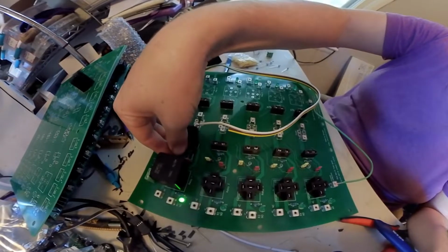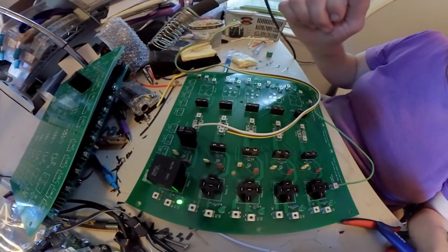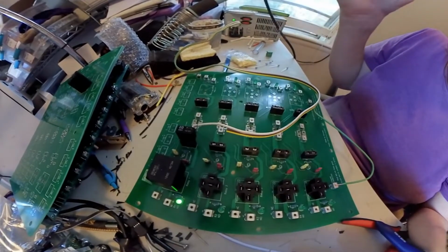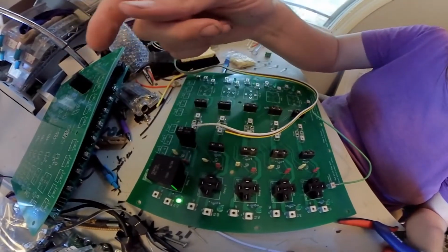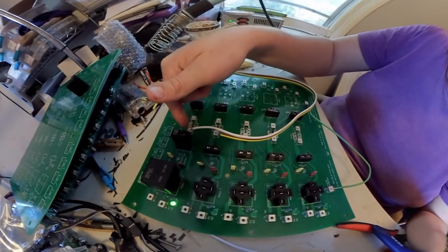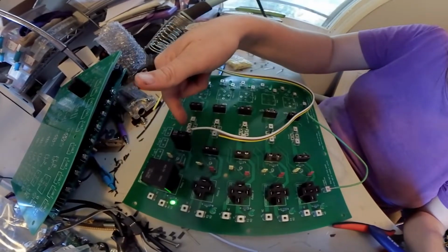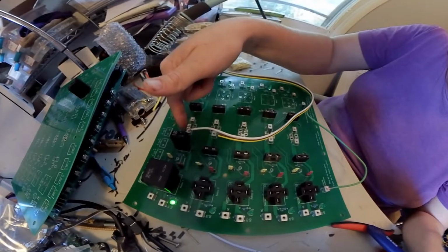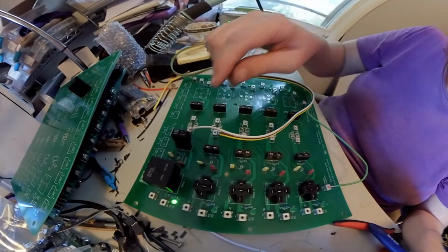And by that working, that can be set up like that on the board. I don't even have to use that. It's just anytime there's power here, there's power there. And I can just kind of use it as a bypass, as a cheat sheet as to whether the relay's not doing anything. But I can also hook up my accessory cable to this line here, or even up here as a control. I could hook a high load to this and then run all these off of accessories and have them come on or off when the accessories are on.